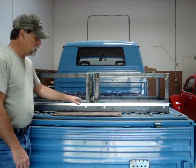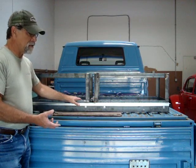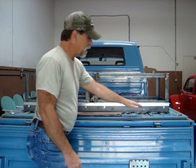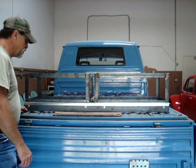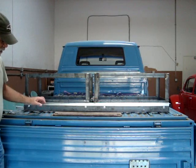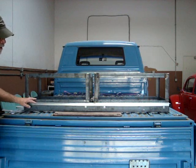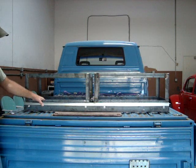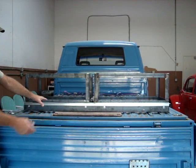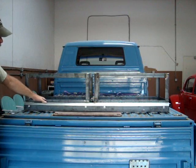So what we're going to do, like we do on most of the VW and unibodies, where there isn't a place that's got extra support, is strap it. We will have a strap that will run underneath the vehicle and basically be sandwiching the sheet metal of the floor of the treasure chest between this 3/16 thick angle and our strap, which will be 2 inches wide and go the full length, and have probably 5 attachment points on each side.